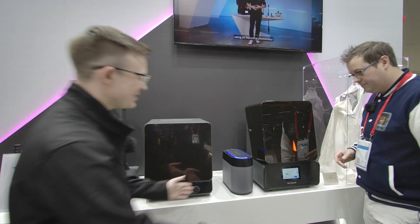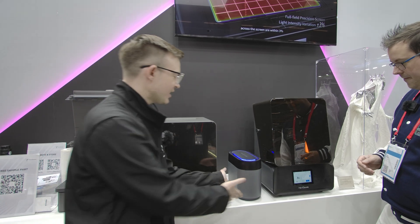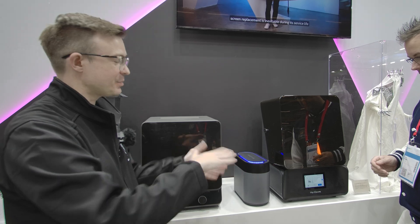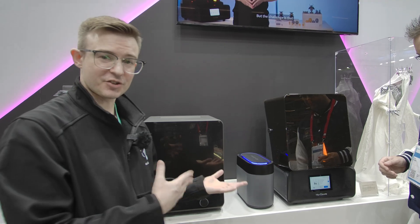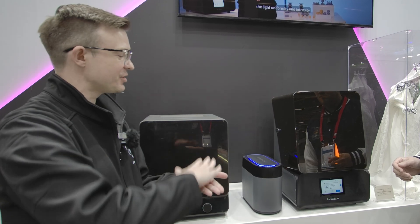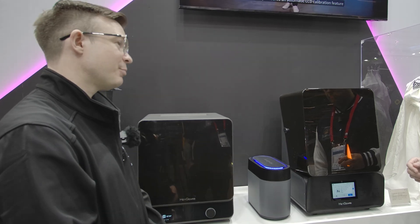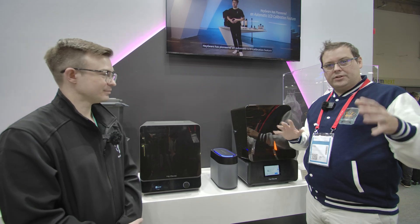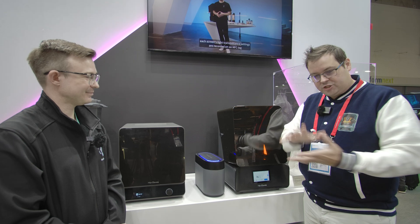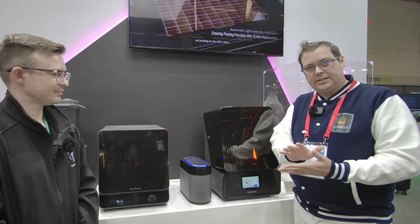So what is the glowing thing on the machine? It's their Pulsing Release Module, which is also compatible with last year's Reflex. It uses compressed air to inflate the nFEP film, which reduces the peeling force per layer. Because of that reduced peel force, depending on the model structure and material, it can mean fewer supports required, more resin saved due to reduced support structures, and potentially faster 3D printing overall.